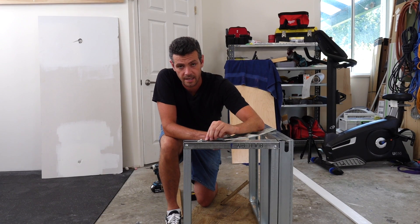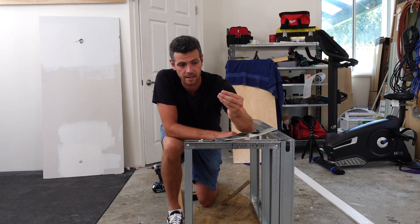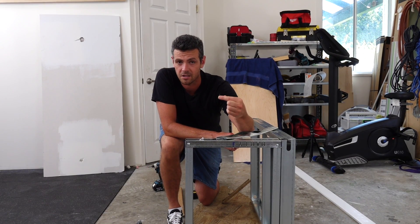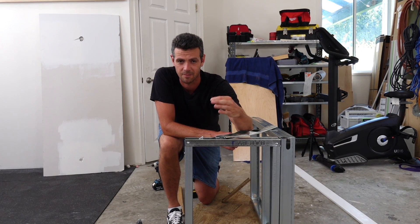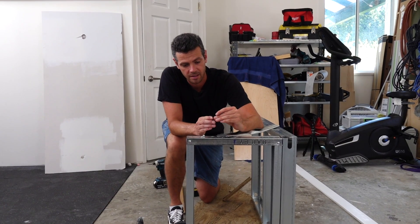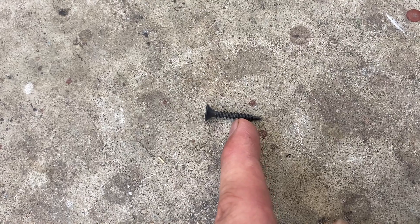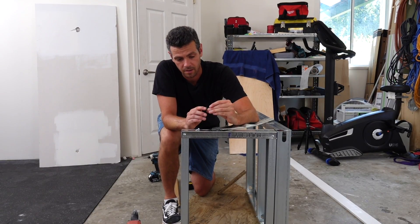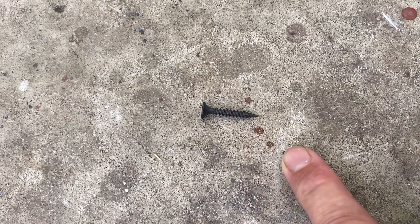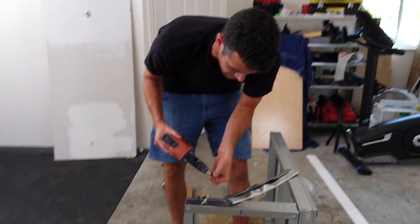Only one of these is intended for fastening the half-inch drywall onto this light gauge steel stud, and that would be the one-inch fine thread drywall screw. You could also use an inch-and-a-quarter fine thread screw. The reason one-inch fine thread works well on half-inch is because it still gets to the full depth of the threads, whereas if you tried to use five-eighths board on this, the five-eighths would start to come up to where the threads get smaller and it wouldn't be in the exact right spot. We'll start with the fine thread, because that's the one we're supposed to use here.